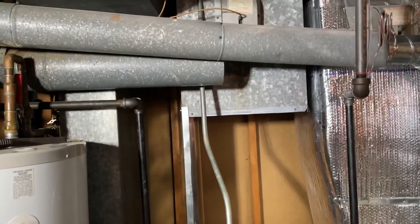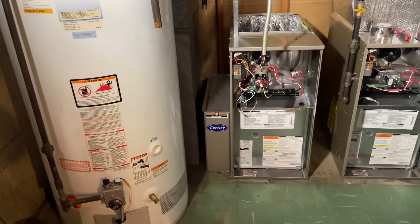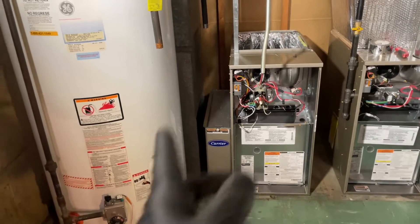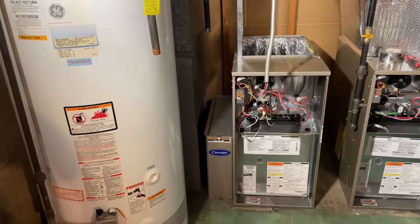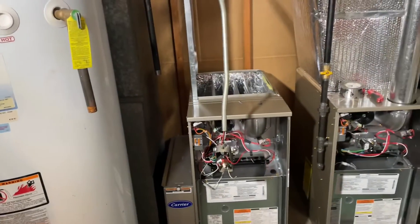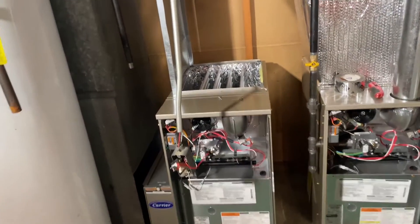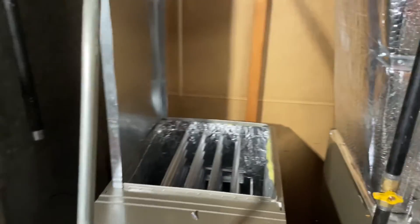We're starting the other side now. I've got my first piece in — we're dead vertical, perfect. We're going to have to make up a transition over there; not fun, especially not fun with an emergency retrofit. It is what it is. I didn't want to use the old filter racks because he never really changes them. So we have a little more separation here because these are 17-inch models going to 19 inches on top. So we made this one, now we do this one.